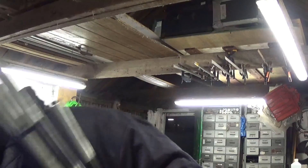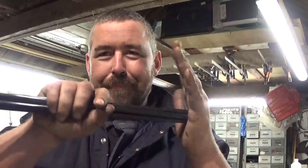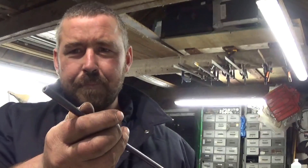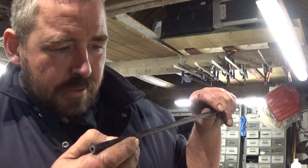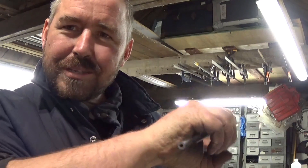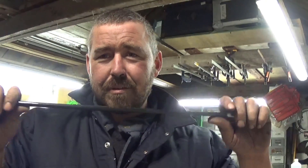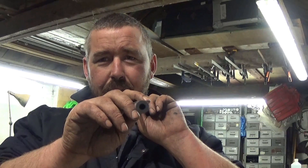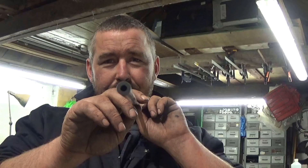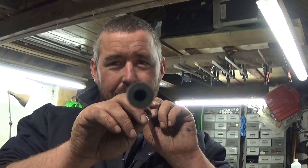These are so cheap — it's the cheapest way you can buy anything round, basically an untapped resource as far as I'm concerned. Cheaper than wood, cheaper than metal, probably almost as cheap as air. These are glass fibre pultrusions. The fibres are aligned, which means it comes through a die and the fibres are put in as it's extruded, making for a really tough material — no heat resistance, but as long as you don't put it beyond its elastic limit it'll always return to perfectly straight.